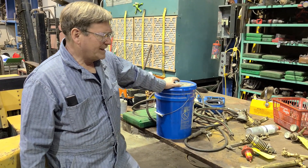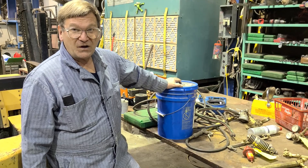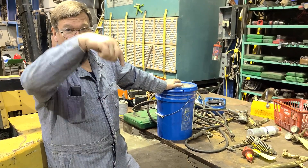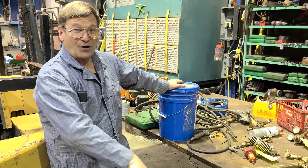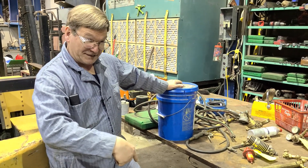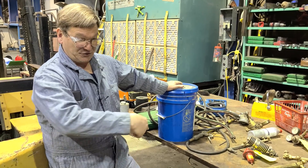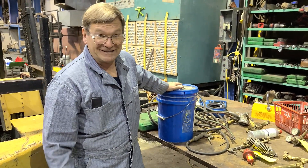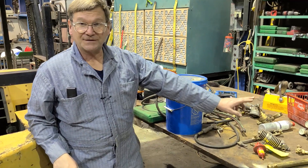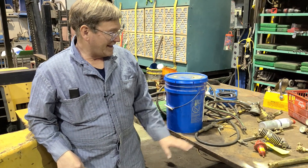Plasma — if you've got enough amperage you can go through pretty good. The bigger plasma torches will do six inches, but plasma also doesn't cut straight down; it likes to wander a little bit. If you've got magnetic interference around things, it will wander and generally pick a side. Your newer, nicer plasma setups, when cutting thicker stuff, will compensate for the angle — you keep one side, and an extra axis swings away as it progresses so your piece comes out nice. But a torch will still be straighter, and that torch right there with the right tips and acetylene gas will cut through 12 inches without a problem — so there's a place for them.